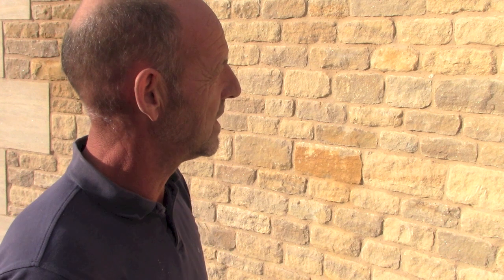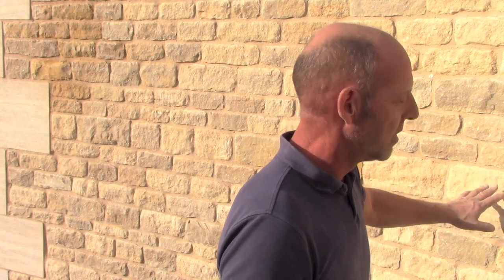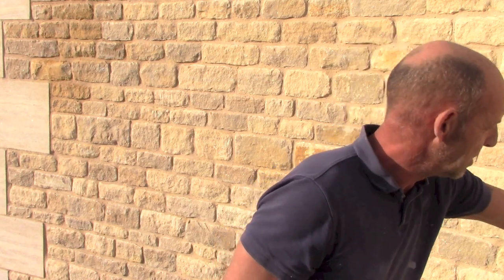That's really interesting. If you use a point mortar with 5 and 1 or 3 and 1 — which you probably see on some old buildings — you can see where some of the face of the stone has fallen off, but all the mortar is still in position. Because it's stronger than the material, and it's breaking it to bits over time.